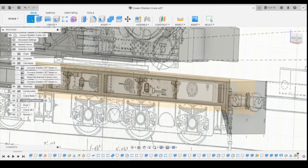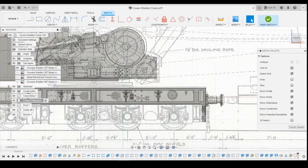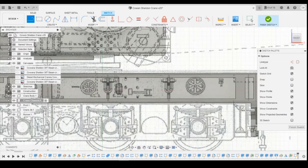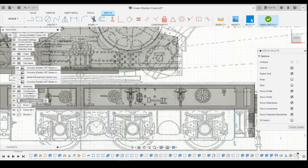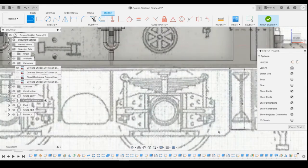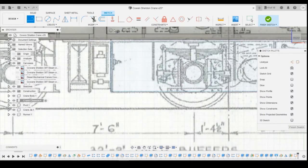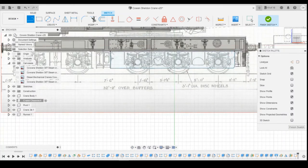Okay, so now we'll create this sketch on that plane we've just created and we can draw using a line. I think we've got this little cutout here, so we're going to start in that position and bring this down. The first thing we'll do is constrain that to that height there, and then we can move the height of this back up and define that height there. Okay, 4 millimeters. If we scroll down, we can create the diagonal line here. That looks about right. Then we'll do a straight line all the way across to here, and snap back into the top there. And just to close off, we'll do that line across the top.